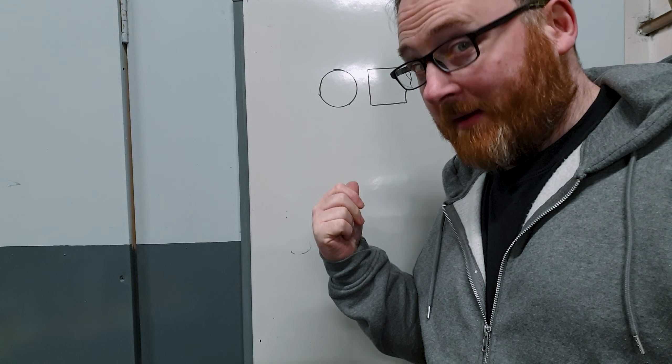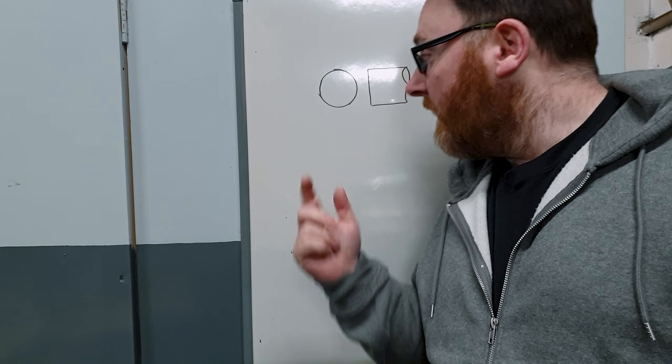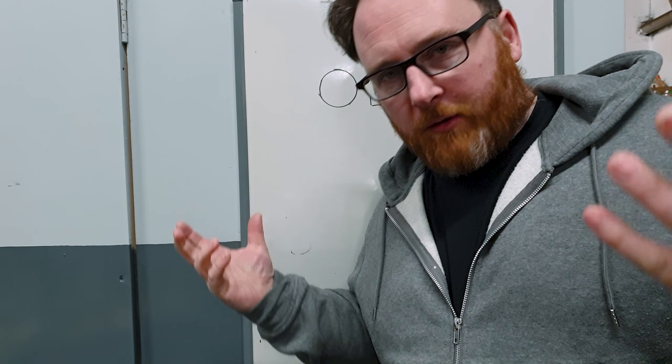My art is getting better by the day. What we've done before when it comes to filleting fish mouths, bevel cuts in tube steel — call it what you will — we previously did the arms for the locust. When we did that, we went to a website, printed out a sheet of A4 paper with the profile of what the cut was meant to be, wrapped it around, used a marker pen to trace the profile onto the tube of steel, and then cut it out with an angle grinder. It's a bit of a long, windy process but it was fairly accurate and it did okay.